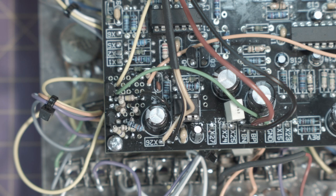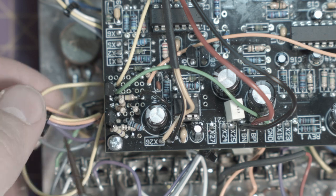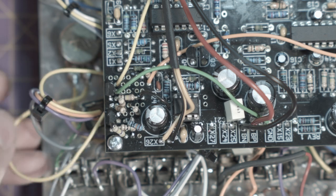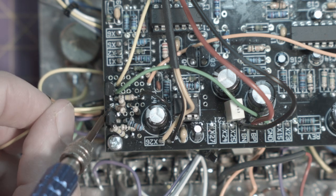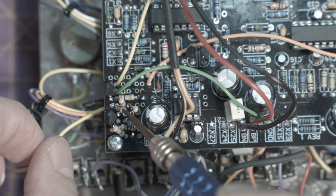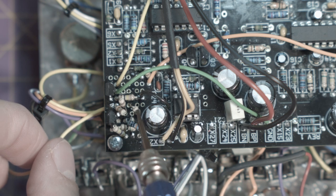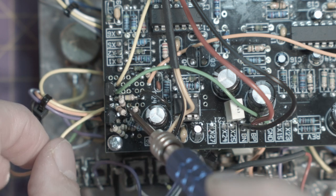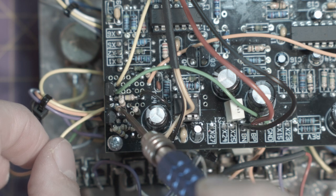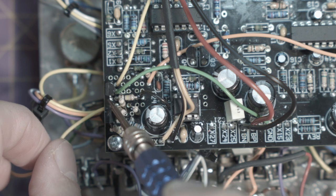So the end result here is, we have our yellow wire here. Wait, no, this one. Our yellow wire is coming through and is connected on the underside of the board here. And then it goes through our 39K resistor. And these two holes are connected. This is our 100K that is coming from the battery positive terminal. Then we have our 39K resistor that is sharing the same hole as our other 39K. That is then connected over to the gate. That is the gate side of our transistor.